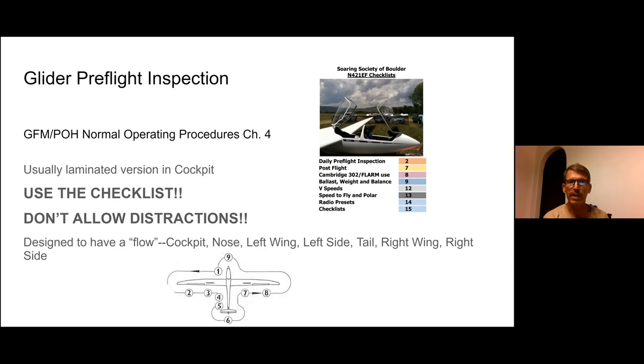I would say, in my mind, usually it's going to result in a bailout, and hopefully you can fly the aircraft to a flight regime where it's easier to bail out. There's always a possibility that you could do some sort of controllability check if you're high enough. Maybe the faster you fly, the better the controllability is, but as you get slower, it's a little more difficult. So you might sequentially slow down and make sure that, hey, I still have roll control, or I still have yaw control or pitch control.